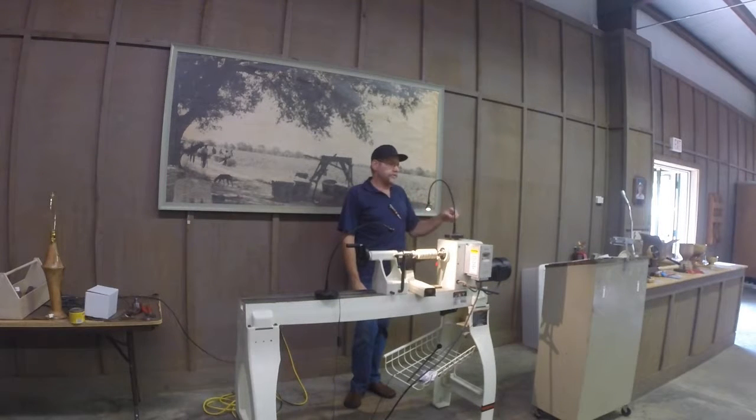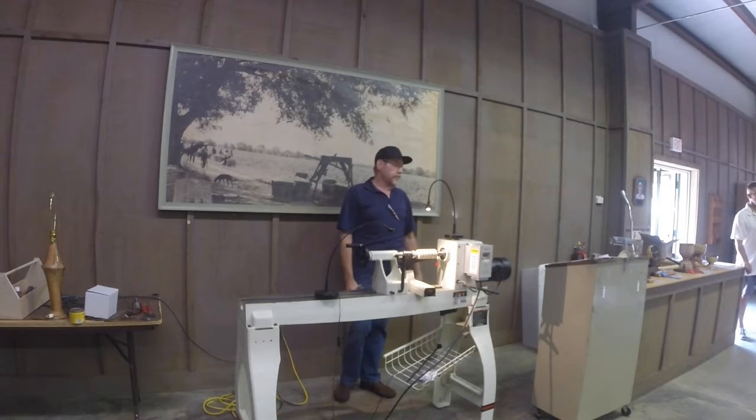If you put a whole bunch in there, you activate it, and you see it skim over, it's hard, you start to cut it with a lathe tool. You cut that skim, you'll always be wearing a nice coat of speckles all over, because it'll sling that super glue all over. Yeah, it's wonderful with glasses.